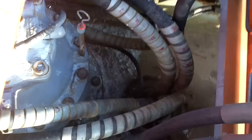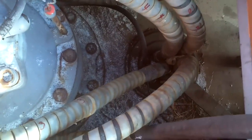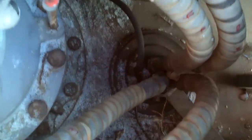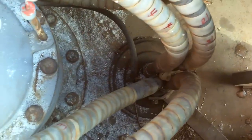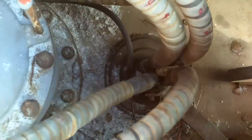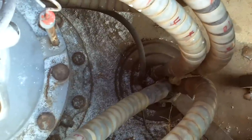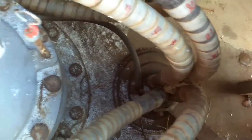From the top side, if you look down here, there's these four hoses — two for the left and two for the right — and then there's actually a little one that comes off there too. So there's five lines that run down through this spool, and that's what transfers the hydraulic oil down to the wheel motors. I've got a spool in the shop that'll show you how it works, so that you can spin the tracks around and around forever. There's no hoses to get tangled up.